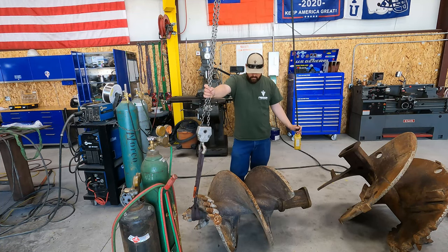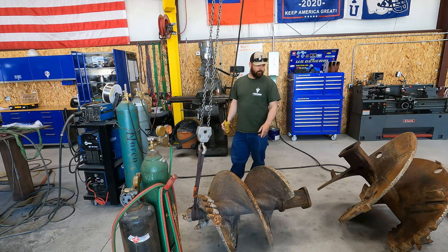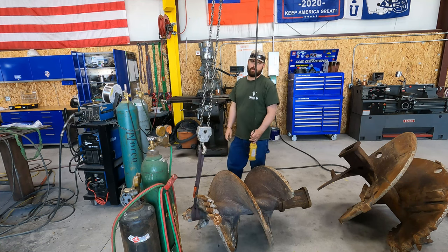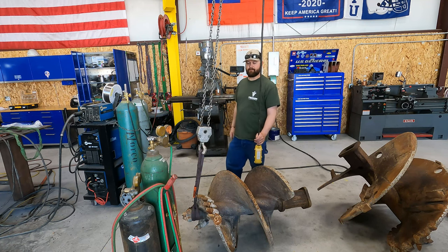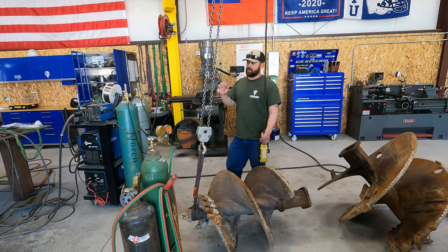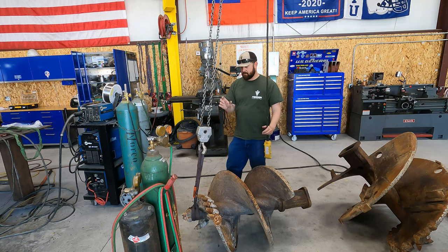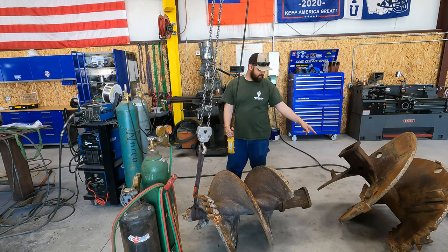All right, here we are, another day, another dollar. So we're gonna move on to our number three bit. We've got to get the pilot bit out of this one. We're either going to spin it out or we're going to cut it off. If we can't spin it out, we'll cut it off, but I want to try spinning it out first so that we can get our new keyway piece machined and fit onto this and weld it out.